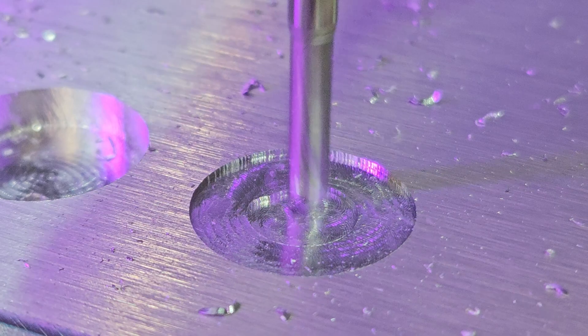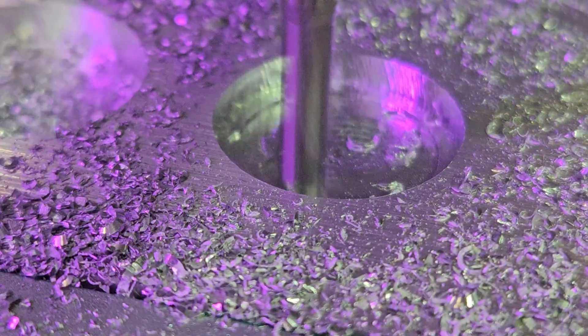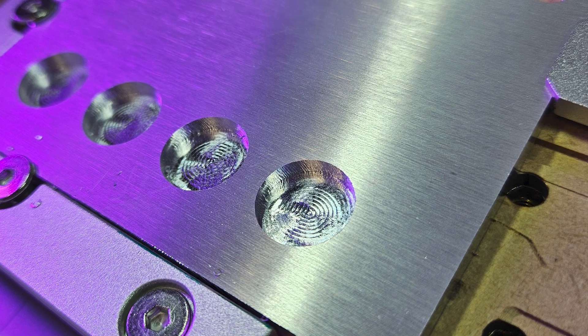I moved on to doing some test cuts in aluminium because I know a lot of you are looking at this machine for metal work. It's not an area of expertise for me — I just kind of hope for the best for my feeds and speeds — but all the tests I was putting it through were cutting great. I was getting a bit faster each time, going a little bit deeper to see how results varied. Now, there were some concerns about this being just a 200-watt spindle, but in actual fact a 200-watt closed-loop spindle is cutting through the aluminium absolutely fine. It's not going to be hogging it out like a massive spindle would, but that is not the purpose of this machine — this is about precision.